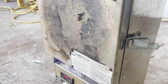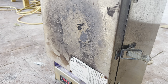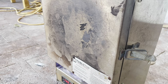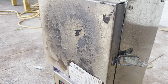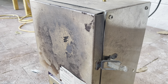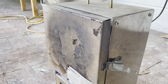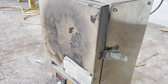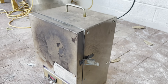We've got this in here now. What we're going to do is melt this lead with all this gold and other base metals inside. The lead is going to oxidize off and get absorbed by the cupel inside of this furnace, and hopefully pull all that copper and brass and nickel and all the other nasty stuff out of there, leaving behind a bead of gold and maybe some silver. Once that occurs, we will take it out — there won't be any lead left — and we're going to chemically refine that bead to get it to 24K.